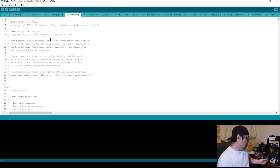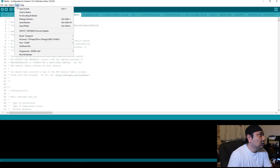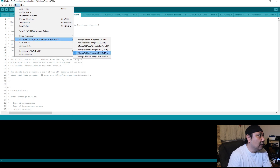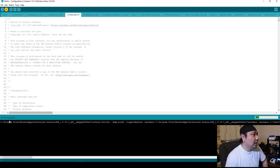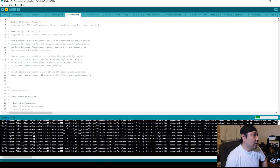You're just going to plug in your printer with the USB micro cable. Then go to Tools in the Arduino IDE. Make sure you have the Sanguino board selected, then go to the Mega1284 option and select that. Select your COM port, and go to the Programmer AVR ISP MK2. Or if that doesn't work, try Arduino as ISP. Go ahead with AVR ISP MK2 as number one and Arduino as ISP as number two. Then just click Upload. It's going to compile the sketch, and when you're done, it's going to say done uploading.